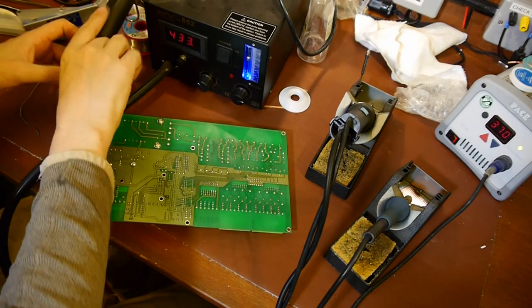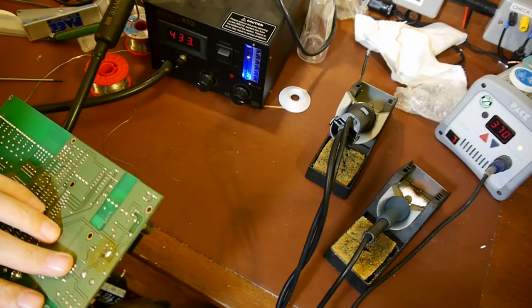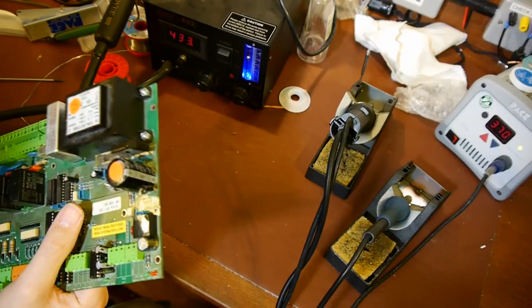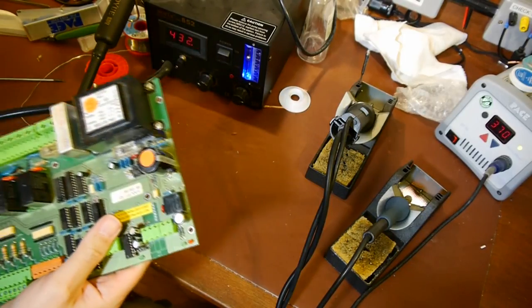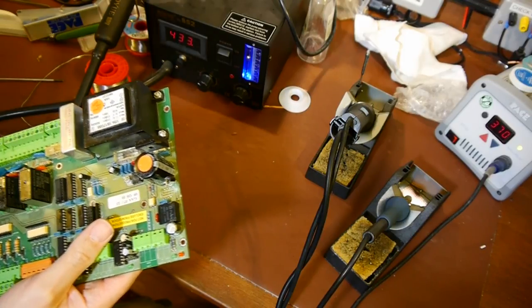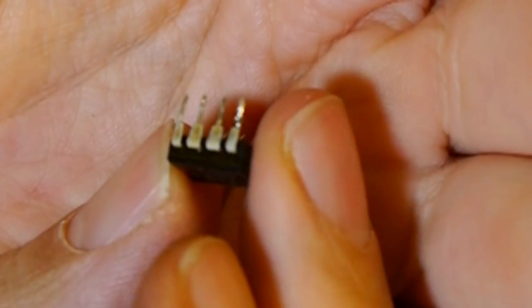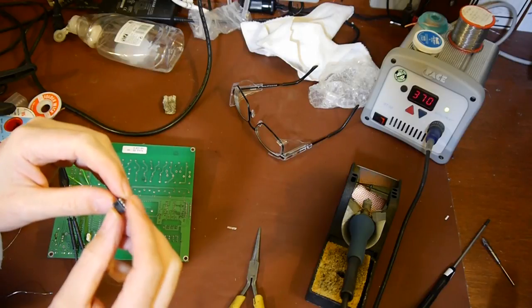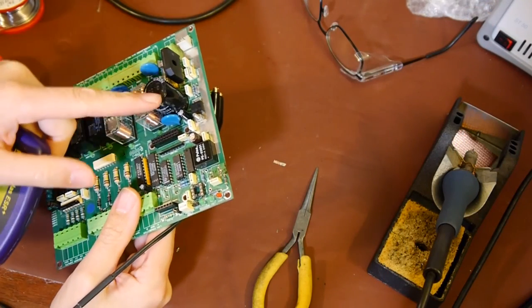Okay, there - the little bugger went winging off there, so we got it out. We've got one very hot but actually undamaged board. Does anybody think that's a reasonable technique for removing difficult parts - just putting the hot air gun on them? I certainly seem to have done less damage to the pads rather than poking about with that solder sucker. You can see the pin on the far right has a little wedding ring on it, so it has pulled off some of the through-hole plating. It's an LM2675 - some form of SOIC switching regulator - so I was right.